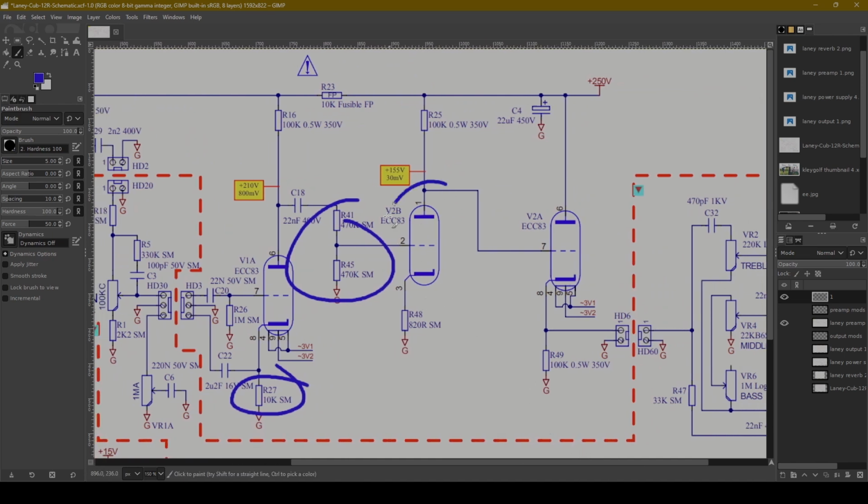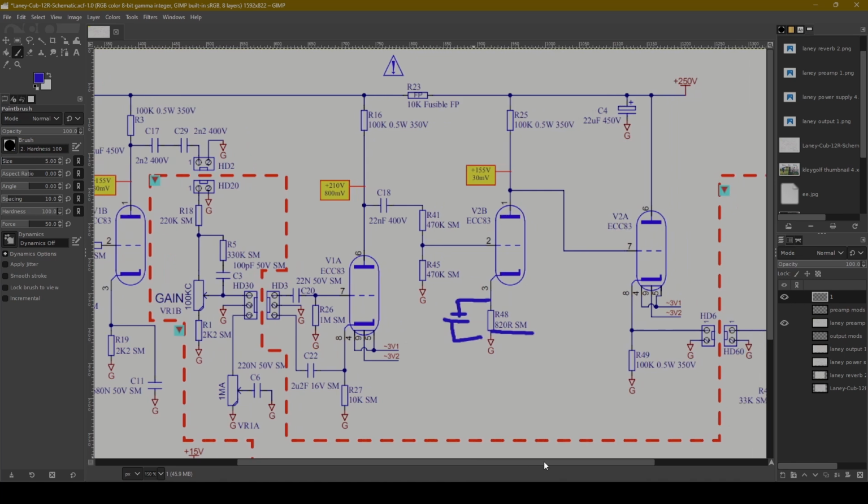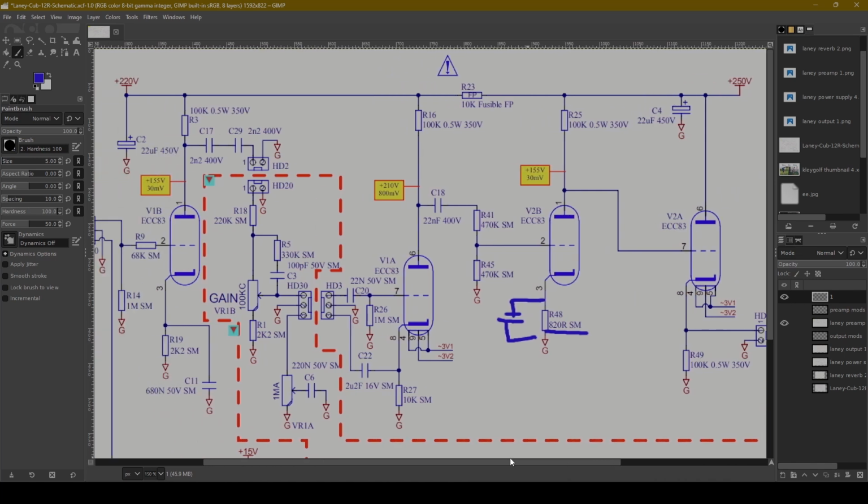Next, another gain stage. This is V2, 100K on the plate is fine, 820 ohms. This is basically the opposite of this 10K. This is a very warm bias resistor, and again, no cap. So you could put a bypass cap, you could change this value. I'd be kind of curious to see what this amp would sound like if you had 1.5K bias resistors, 25 microfarad cathode bypass caps in all three of these spots. That would be kind of an intriguing change to me.